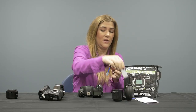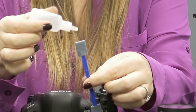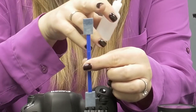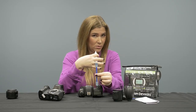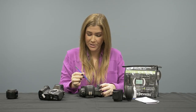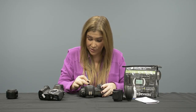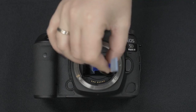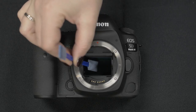I'll take my wand and solution and apply a few drops to the wand surface just to saturate it — you want to see it fully saturated from end to end. If you accidentally oversaturate, the wicked area in the center holds any excess solution inside the wand. Put it into your sensor chamber, start at one end, touch the sensor surface, move it across one way, then change the angle about 45 degrees and move it the other way across. Then take it out, immediately flip over, and do the exact same thing with the dry end.